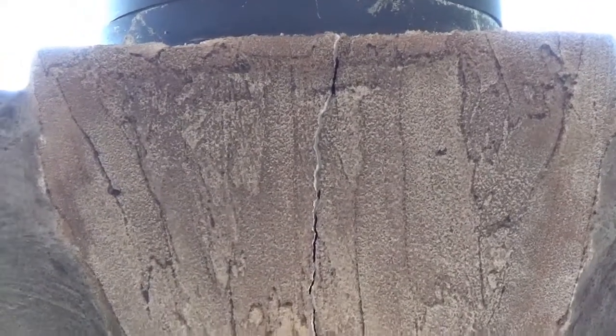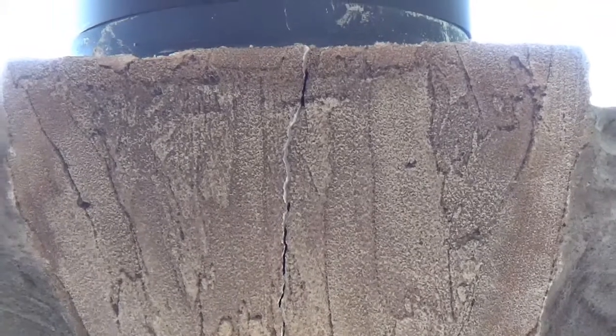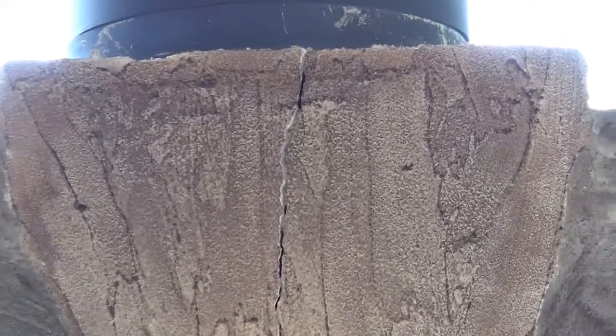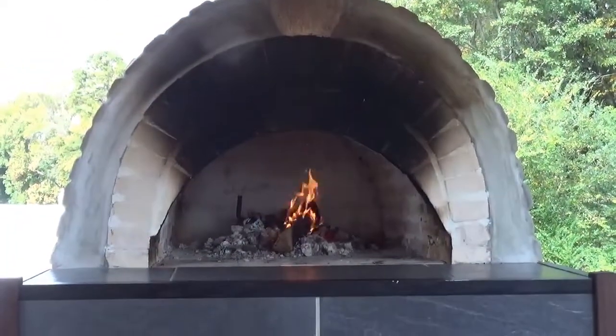All those other things that might look like cracks, they're not. They are unevenness of the mortar mix. And that's one good thing about it: that was pure cast mortar. Now what do I mean by pure cast mortar? Pretty simple. I just took a form, put it around my pipe, and then filled it with mortar and tapped it and made it nice and tight. No supports, no zippity doo-dah, no nothing.